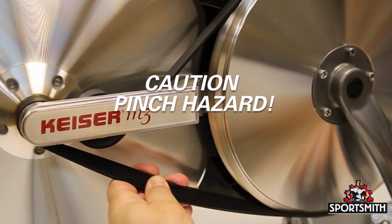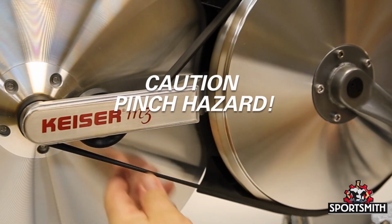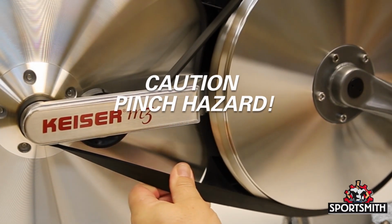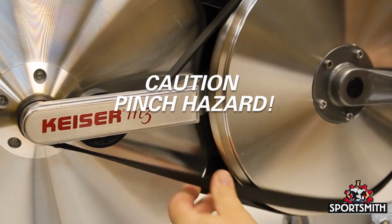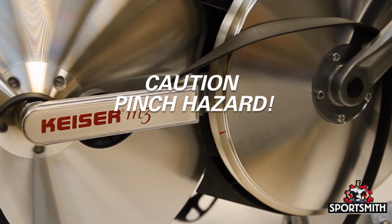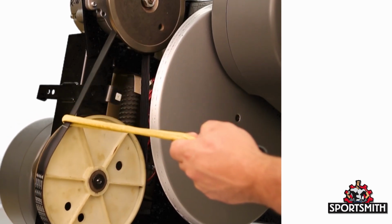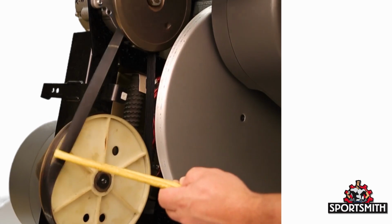There is no way to remove the tension on the machines without an idler or tension assembly, so it can be quite difficult. Some people will simply push the belt to the side while turning the pulleys, which can be very dangerous. An easier method is to use a piece of string or a bungee to pull the belt to the side while turning the pulleys.